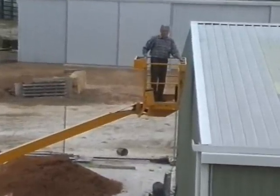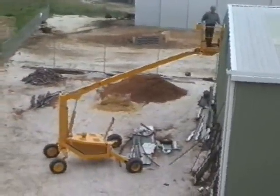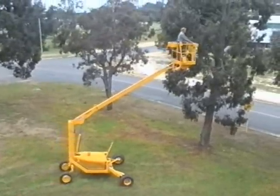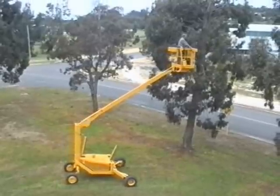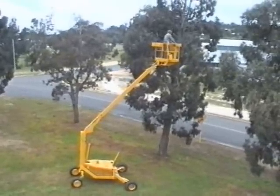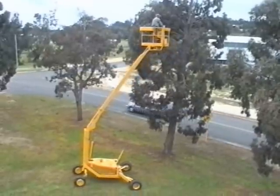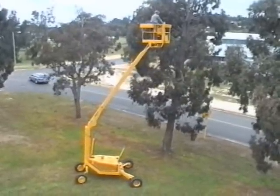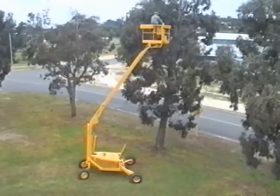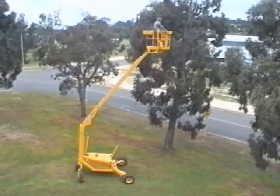The 805 Squirrel comes with a wide range of options, including air compressors at 6 CFM, 18 CFM and 30 CFM; air chainsaws; air chainsaw bar dip racks; multiple crate holders; standard picking bag; deluxe picking bag; dual drive wheels; tail lights; amber flashing light; 2-man cage; 1-man cage hand control; low voltage insulation; Kubota diesel engine; and hydraulic wheel shift.